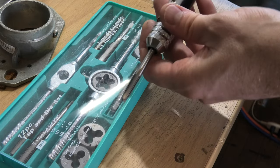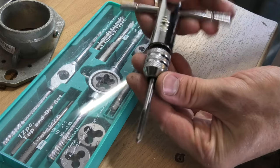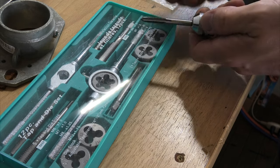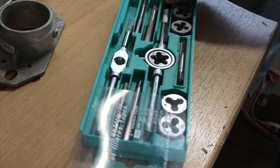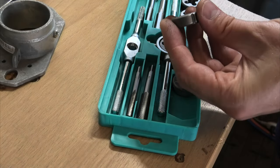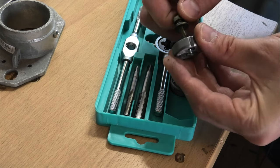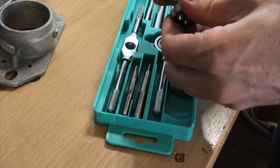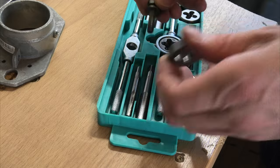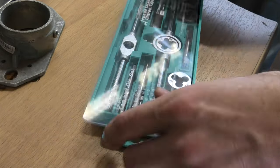This is the one I think is correct - it just came with a cutting part, M6. So that's a six millimeter tap. If you're reconditioning old machines, sometimes it's a good idea to run these through just with your fingers to sharpen up all the thread. Anyway, I'm using that today.